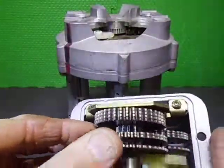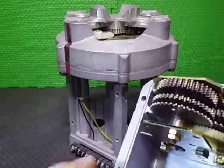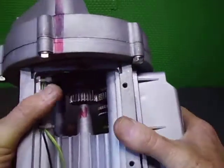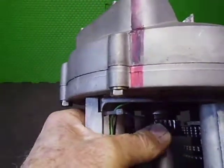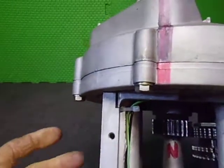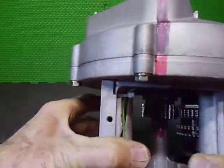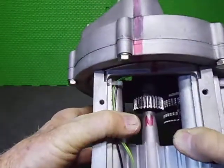There's your gearing, which is all reduction gearing from the motor. The motor capacitor sits in here as well. When it goes into the rotator, the housing holds onto the side of the casing and engages with the gears inside. It also engages on this side, and you can have another motor on the back and the front. Depending on how much rotation torque or brake torque you want, you just increase the number of motor units.